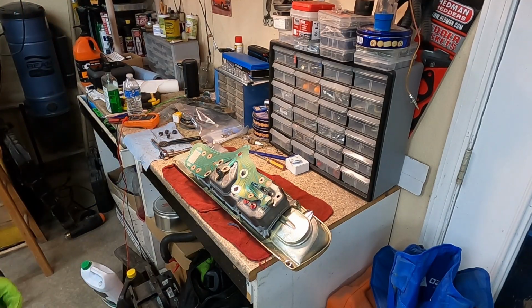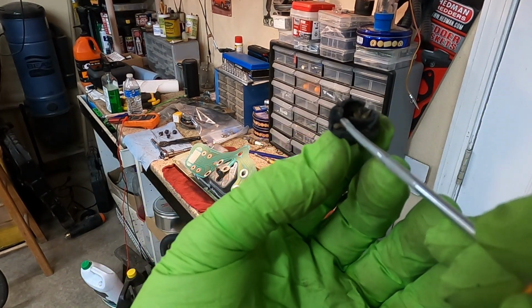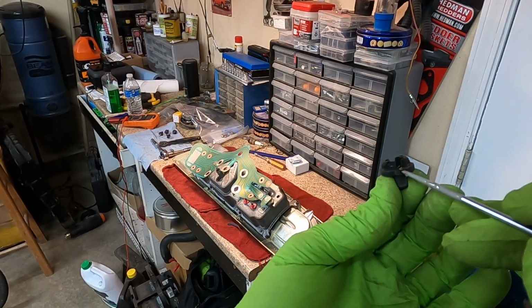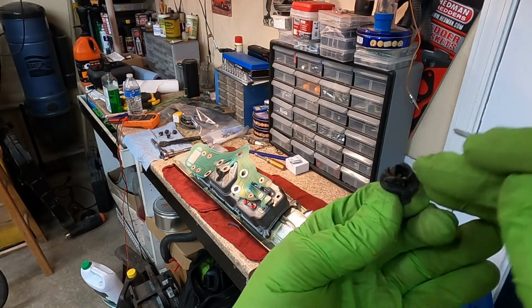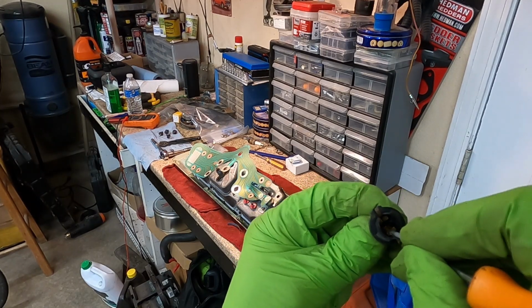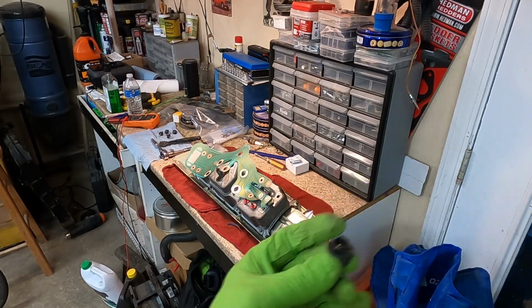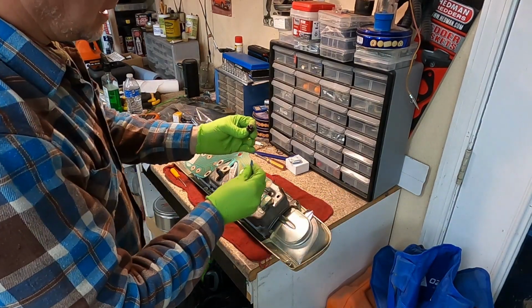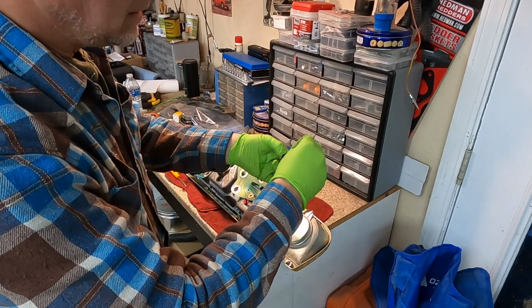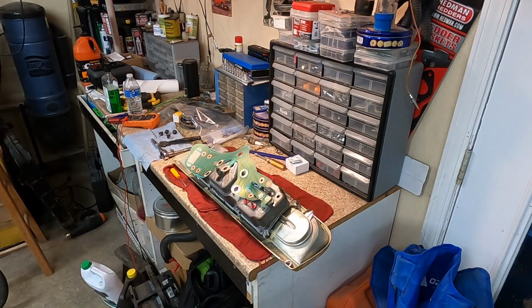You can see these rings here where the bulbs go. These little flanges right here are what is going to make contact when you put that down and screw it in. What I do is stand that one up a little bit. Then I just take a little piece of sandpaper and run it across it. These look to be brass, and you can see that I've got that contact point nice and shiny. That's all I'm doing.